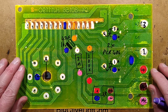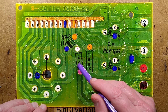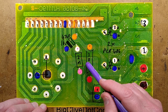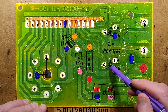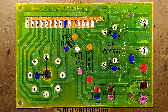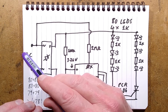The other side of the circuit board: the AC comes in and goes to the bridge rectifier, but one leg of the AC is taken to the zero-crossing detection resistor. The output from the bridge rectifier goes straight to the positive output to the LEDs, but it also feeds power to the circuitry via a 100k resistor, which is going to dissipate quite a bit of heat — over half a watt. There's the smoothing capacitor, the switches, little row contacts, and the two thyristors — PCR406 very sensitive — in position. The circuit board can take four thyristors but they've left two positions blank.